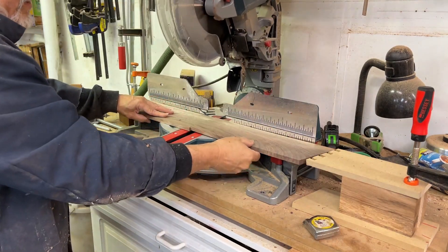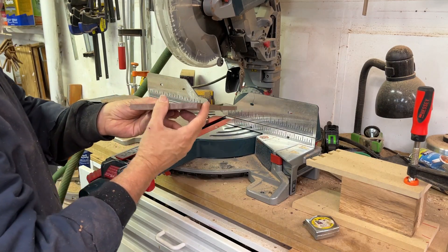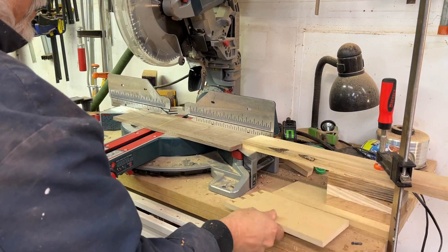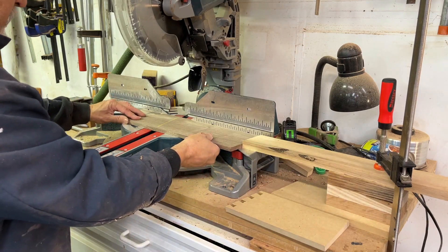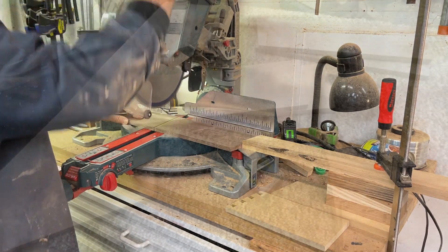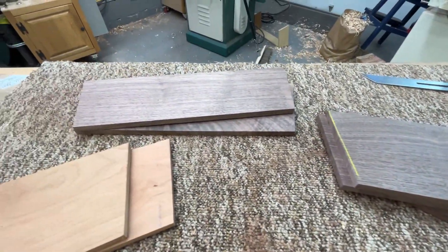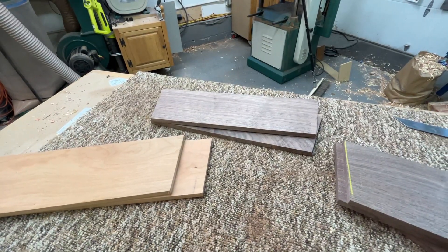It's nice having this angled stop block. That line's not quite right. There should be a bevel angle on here also, but that makes it more difficult to put into the dovetail fixture — so I'm going to do that after all the dovetails are cut. I cut another bevel on a scrap piece of oak and trimmed all the ends. Let's take stock: I've got two sides and three ends of cherry, and likewise with the walnut. Now it's time to start marking these up, because it's going to be really easy to make a mistake with all the different angles.